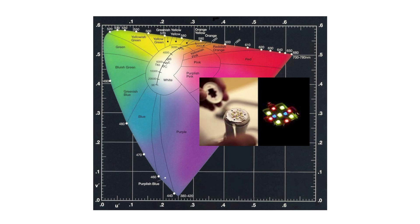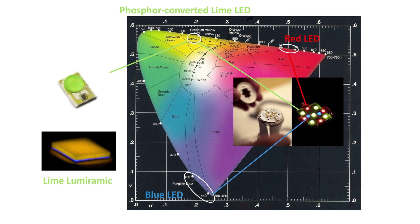To learn more about how that technology works, we need to take a look at a color chart. Here we can see the inside of a Hue bulb — it's been cut away, and you can see there are three different kinds of LEDs inside. There's a red LED at about 610 to 620 nanometers, blue LEDs at about 440 to 460 nanometers, and green LEDs. These are very special and unique LEDs to Philips Lumileds, made using our proprietary phosphor technology, Lumiramic.